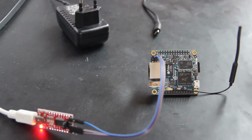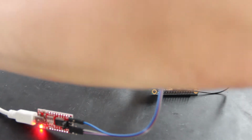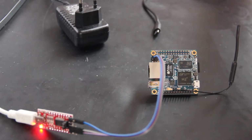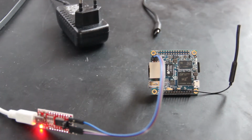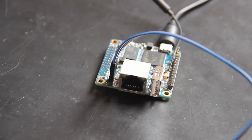So let's go to the device manager and check which serial port we've got. So the COM4 port is used by my personal project, so that won't work. So we need to go and enter COM14. And is there any baud rate specified? Yeah, 115200. Alright, so click the open button.